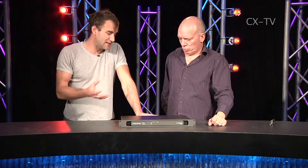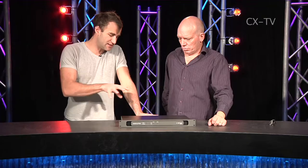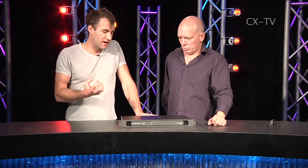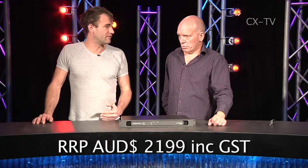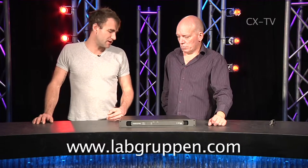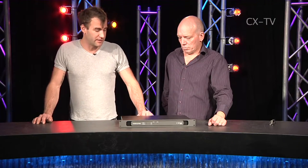There's also a high-pass filter on each channel which can be switched. For energy efficiency, the amp self-manages with signal — when it doesn't detect signal for 20 minutes, it goes into standby mode. The wake-up is pretty fast and actually fades up the level as it wakes up. You can also adjust the threshold for the wake-up signal level, set at around minus 56 dBu by default. It has a single IEC input, one small cooling fan, and massive output for not much weight.